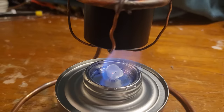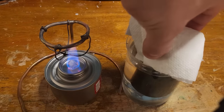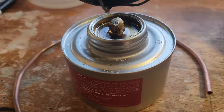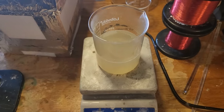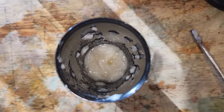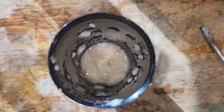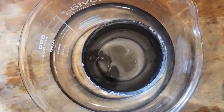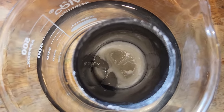I shake up the nitrate solution and pop the cold pack into the fridge to let it absorb heat from the water tank. Once the temperature in the water tank flatlines, it's time to take out the cold pack and regenerate it. To do this, I brace together a little copper frame to hold the can over a burner and boil off the water. Once the water is boiled off, the can is placed into a water bath to bring it back to room temperature. The problem was the water would splash out of the pinhole when the solution began boiling and extinguish the flame on the burner below, so I had to dump the contents into a larger diameter beaker and heat them on my hot plate. Even after solving the splashing problem, the big issue was that the nitrate wouldn't form back into the nice fluffy powder I started with when the water was boiled off — it would form one big crystal chunk, which had way less surface area for the water to interact with, making it take forever to dissolve and diminishing the cooling power. I also tried putting razor blades in the can to create more nucleation sites and break up the crystalline nitrate, but all this ended up doing was reacting with residual nitric acid and turning my ammonium nitrate brown.